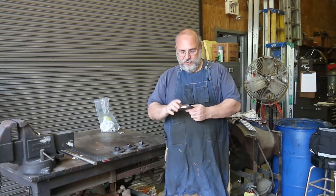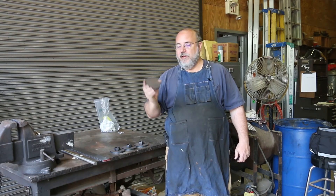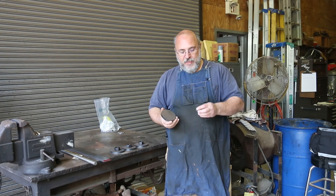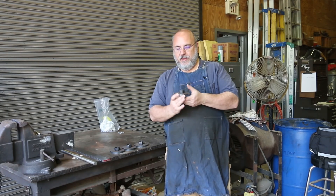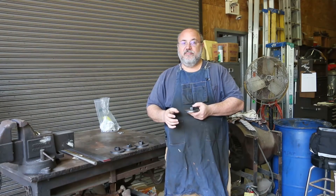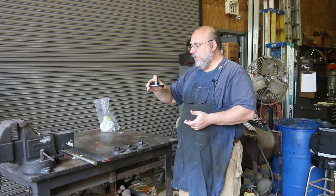These are a little bit different from the McMaster ones — those have a pad where the screw goes in that actually swivels, but mine isn't going to swivel and I don't think it's going to matter. Basically I'm building these out of some 3/8 inch cutouts, probably about four inches in diameter. These were from someone with a plasma cutter — just holes that were cut out. I'm going to take a 7/8 inch nut and weld it to that. I'm using fine threads rather than coarse threads for two reasons: it gives finer adjustment, and fine thread actually holds more than coarse thread.